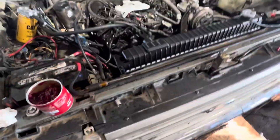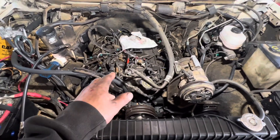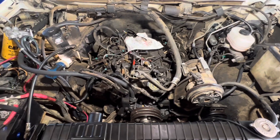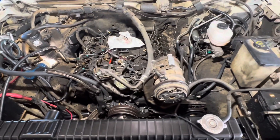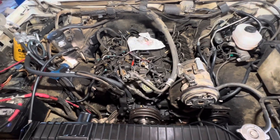When we were popping these off, we noticed a few random ones had intake valve stem seals on the exhaust. So we were thinking somebody just got them mixed up and it's sucking oil — but no, it's like they just bought two kits and put positive seals on the exhaust.